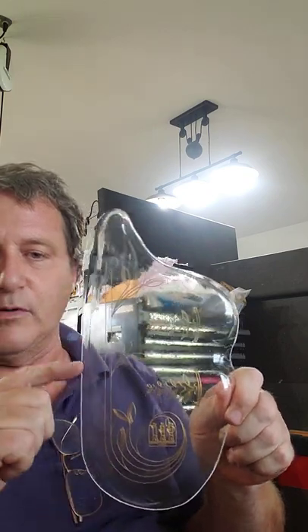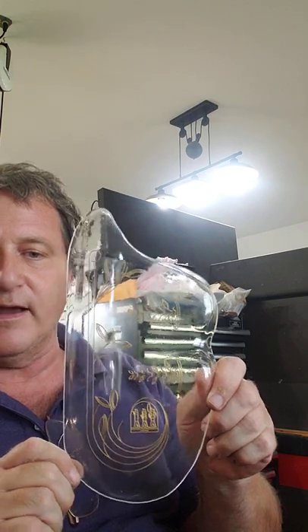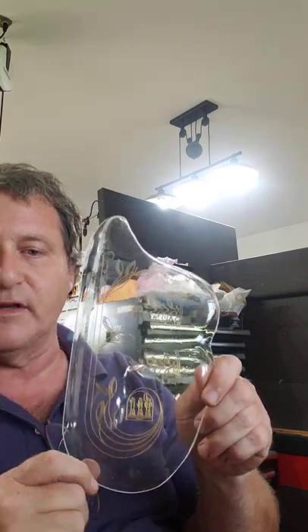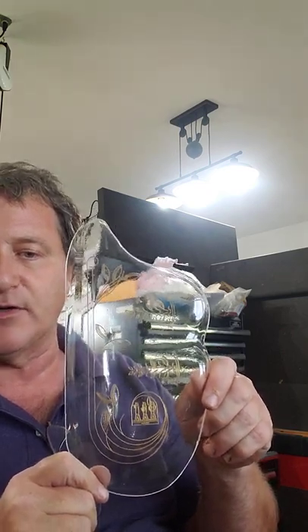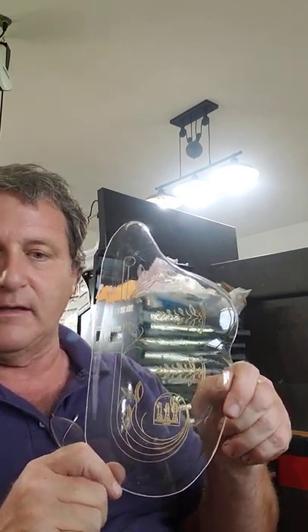Here's one of the broken plastic guards, and here is my replacement guard. I've got a little more to do — I need to trim a little plastic on this side. It's vacuum formed like the original, it's got the three Conn marching men and the art deco pattern. I drew the design and then laser engraved that pattern on there. I build these in my home shop — vacuum formed with a little laser engraving.